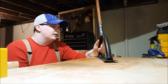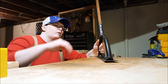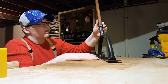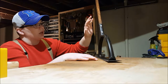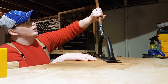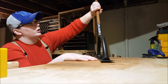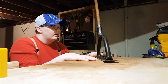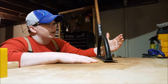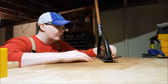It's not perfect. It definitely takes a lot of elbow grease to get off all that rust. Hopefully in the future I'll have a grinding wheel, which will be able to take off the material much faster. But so far, all the tools I've restored, I've restored in this manner. The hardware is all new, except for of course the blade and the braces. This is actually the original handle that I bought it with. Wasn't sure if I'd be able to salvage it, but it had some good sturdy wood underneath the surface. After I cleaned off all the rust, I coated it with some WD-40 just to work in some oil to help keep it from rusting again.